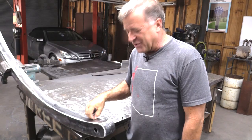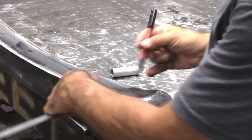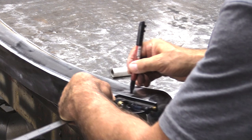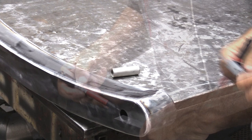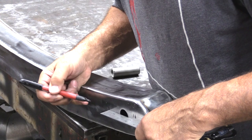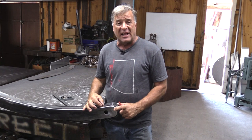So really all I'm going to do is set my square at one inch and give myself a couple of marks. I'm going to come about an inch and a half above the hole and about two inches below the hole — that makes the slot a little bit off-center. I settled on a one inch slot simply because this is three inches, so I'll take an inch out of the center. I'm going to use half inch rod, throw it in the forge, bend up some rings to attach to my bell — half inch rod, one inch slot, quarter inch of play on each side. It'll fit nice, it'll look nice.